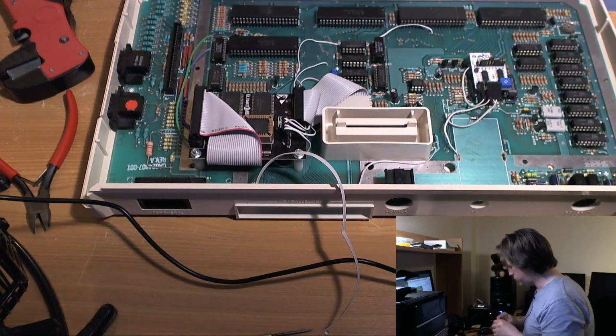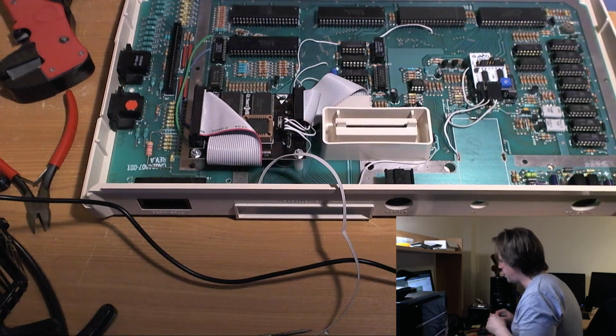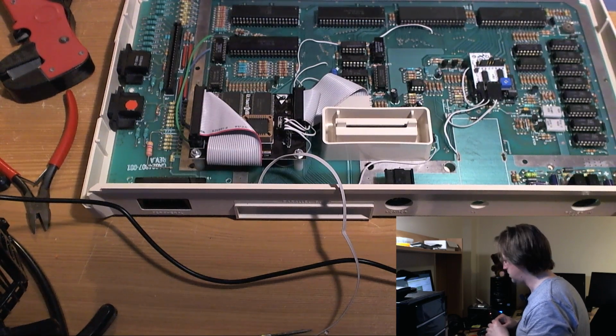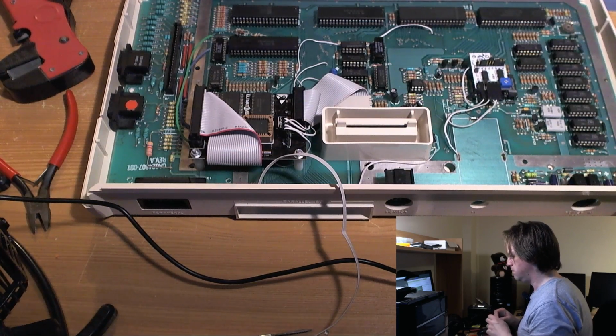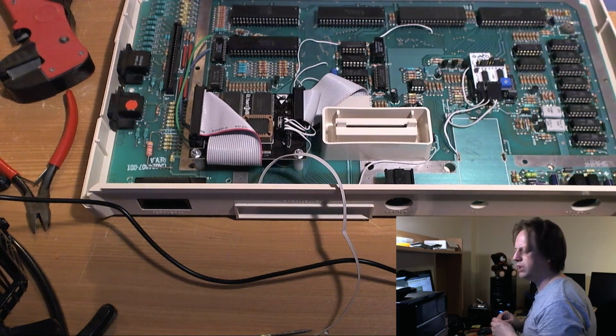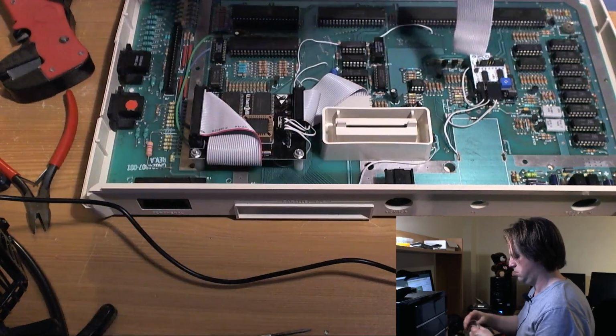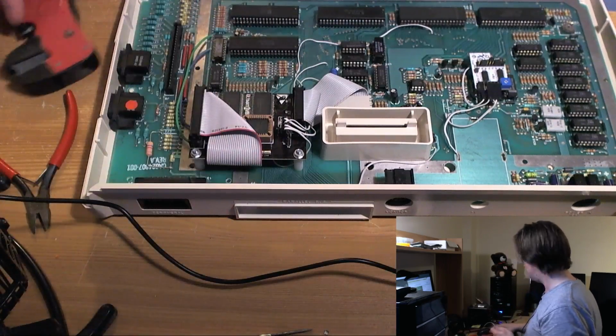Yes, but with some strange behaviour. If I keep the backward metal shield, I've got EMI on the Pokey and phantom key presses. So if you keep the shield on, then you get the problems. So the problems go away if you take the shield off.